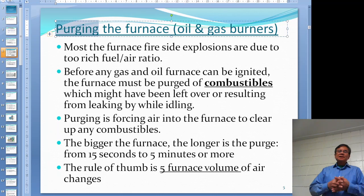How long you purge depends on how big your furnace is. If you're burning natural gas, most furnaces one to two minutes - even three minutes - is probably good enough. But for different or more dangerous fuels, it might take much longer. For sour gas plants burning sulfur, they purge the furnace for a few hours before starting to burn fuel.